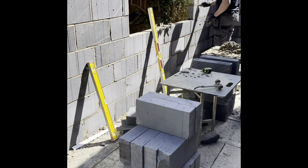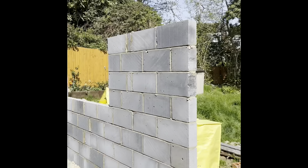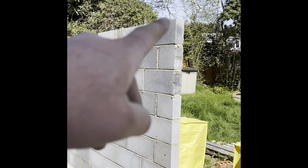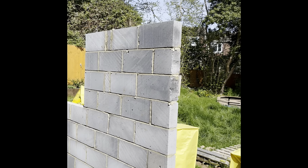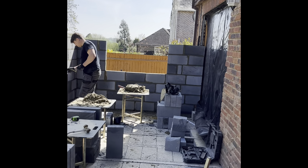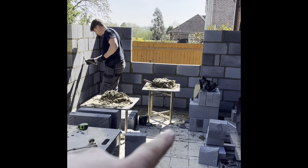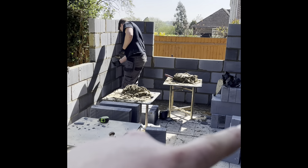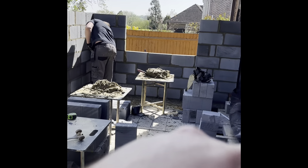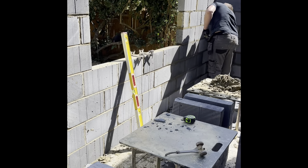That blockwork in this corner is all fired in - got two more on there, two on there, two on there, and that takes us up. There's a 150mm bit on there to lintel. Literally a day and a couple of hours this morning - finished the block and beam this morning. Rolled out 18-inch damp, put a course through, then 4-inch damp. All sweet, we're getting there.